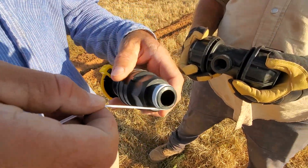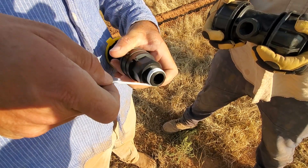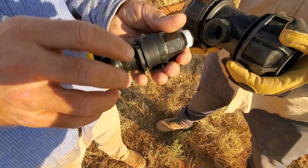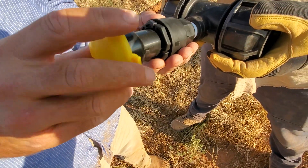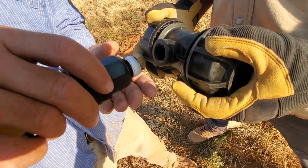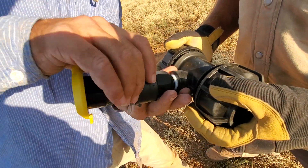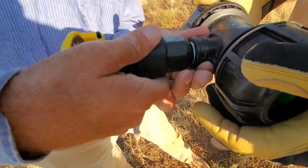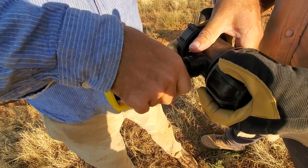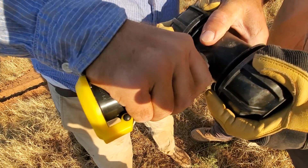Ricardo is putting the Teflon tape on the quick coupler. This is what will bring water up to the livestock tank. He's got two diameters of tape around there, and now he's going to screw it into this fitting — a female threaded T. You can feel it when it goes right. Good job. Now Ricardo is going to screw that all the way in until it bottoms out. The Teflon tape seals those high-density polyethylene threads.